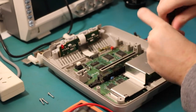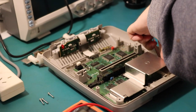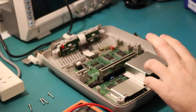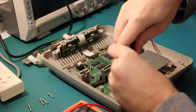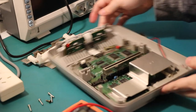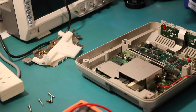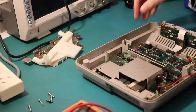So maybe the ones around the RF are longer. Whoa, heatsink's still warm. And make sure you ground yourself often so you don't short anything out. The last thing you want is more artifacting. There we go. Is that all that holds it in? No, there must be more. Oh, nope, there's nothing more.